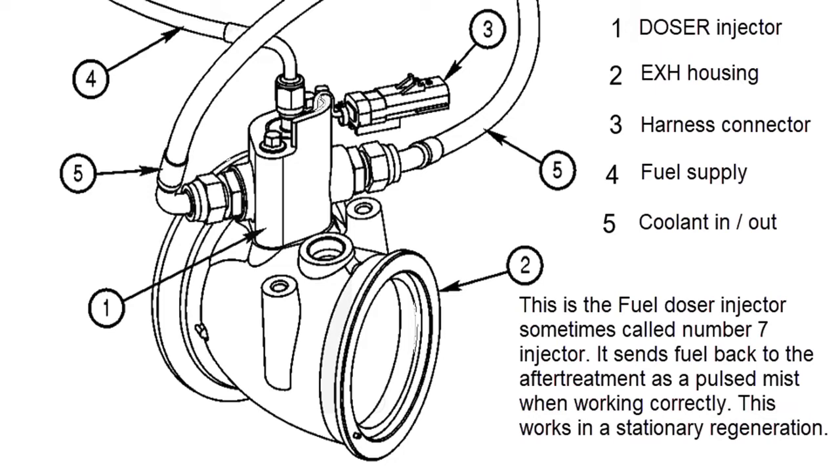Fault code wise, you'll have fault codes if you have electrical connection issues. If the ECM decides the injector is injecting as much fuel as the software allows but still needs more to get the after-treatment hot, you'll get a fault code saying it's reached its maximum limit. That means either the tip's plugged, the injector's not working right, or something else is wrong. There's a reset in Insight that drops it back to the starting dosing amount. It's all about how much it doses to heat the after-treatment up to the temperature it needs, which is about 1,040 degrees.